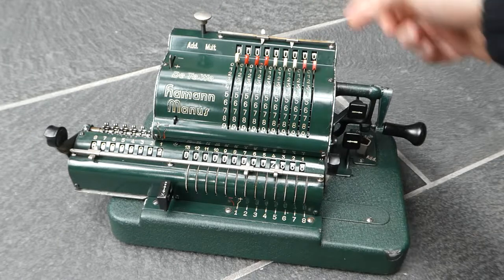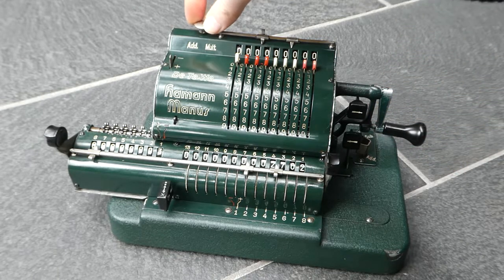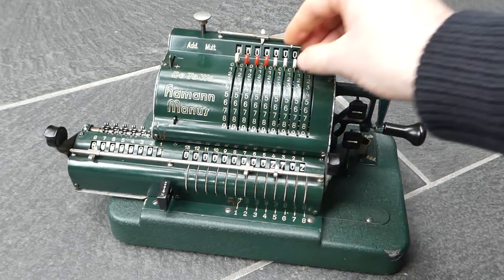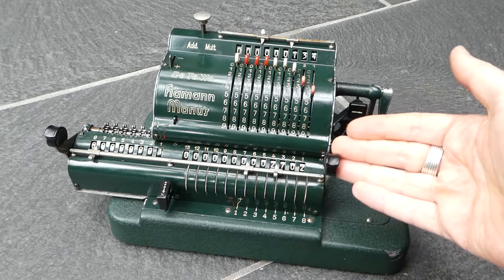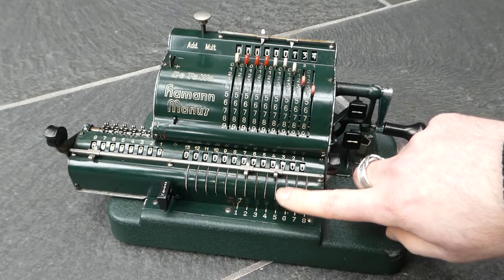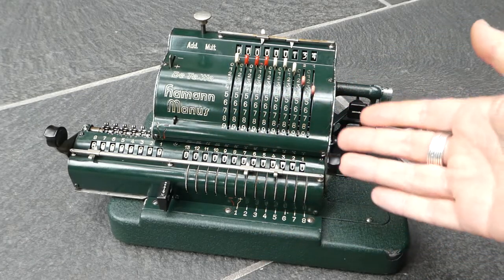That button is pressed each time you turn the crank — you can see it moving down. If I push this button down and rotate it so that its arrow points to the right, that puts it into multiplication mode, so now it will not be pressed when you turn the crank and the input remains. Let me clear the register first with this lever on the right and clear the counter with the lever on the left. The Type F machine has both these clearing levers on the right, so that you can clear both counters with one hand in one movement.